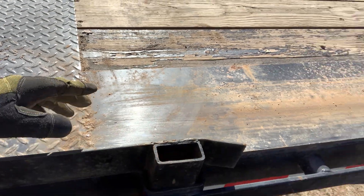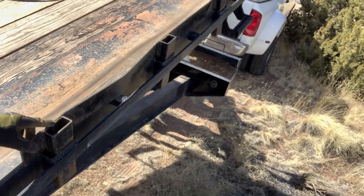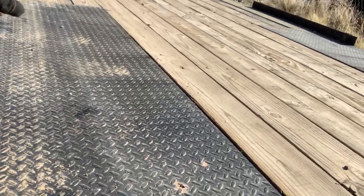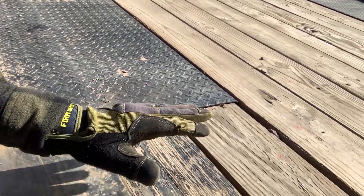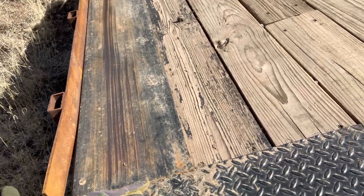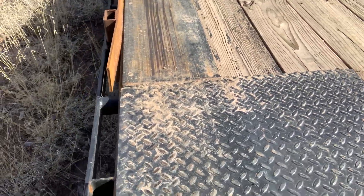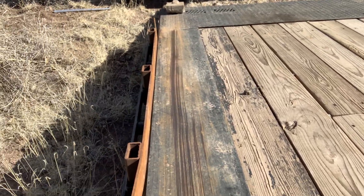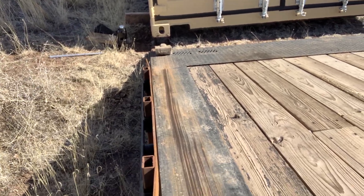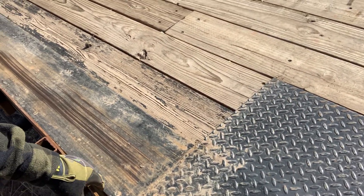Eventually you have to redo it. This has all been welded in place and rosette welded along the sides, welded into the original diamond plate. These bumpers get a lot of wear and tear and usage too — they're all welded but removable so you can put them inside a stake bed. The tail was there; I just connected the pieces so we weren't directly on wood. It's 10 inches wide by quarter inch thick. The plastic pucks do a pretty good job — metal right on the wood would just kill it, even the skids on the wood would be hard.